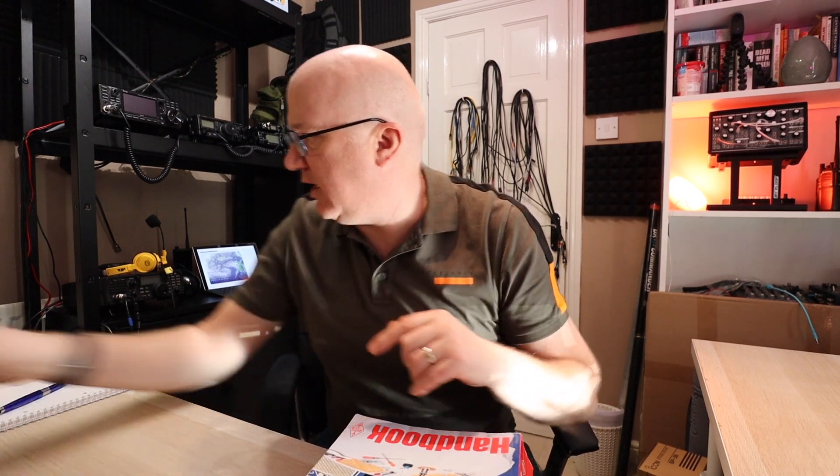Then when I got the new headphones this week and started lifting the power up to 75 or 80 watts, I started noticing a distorted voice in the headphones — a bit like Kylo Ren from Star Wars — and it was definitely single sideband getting into the headphones. My first course of action was to run outside and plug in a dummy load, switching the antenna out. The distortion was gone, nothing getting back into the headphones — so it's related to the antenna for some reason.